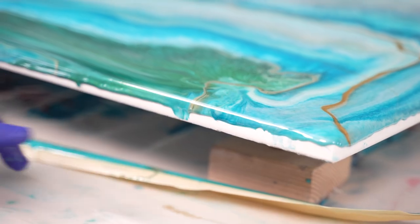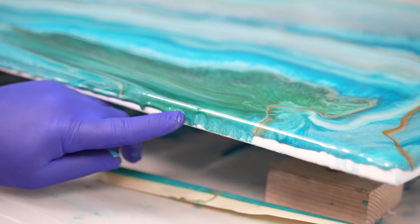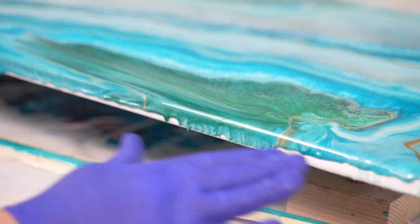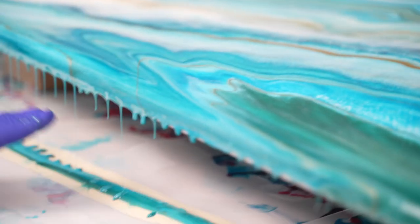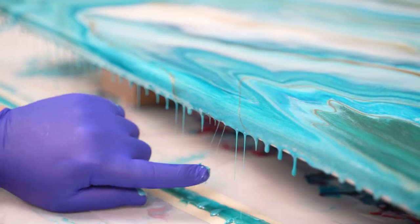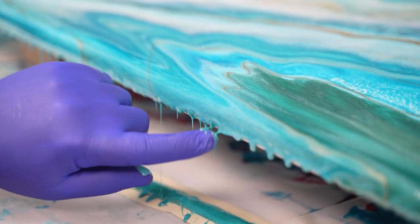So after that tape's been removed, I come and pre-wet my edge. I'm just going to take that leading edge of epoxy. Rather than rubbing left to right and mixing the green with the blue, you want those colors to stay. So just wet below it, kind of encourage the epoxy. Like down here, we're good. I'll just come here and get any dry areas, you want to make them wet, then the epoxy will flow uniform. This is perfect timing.